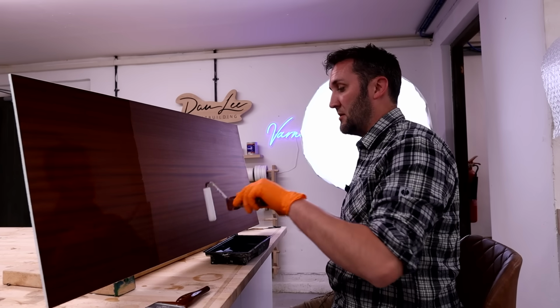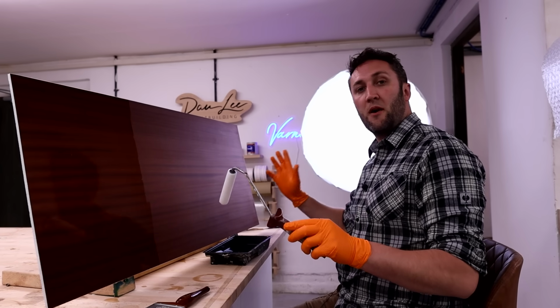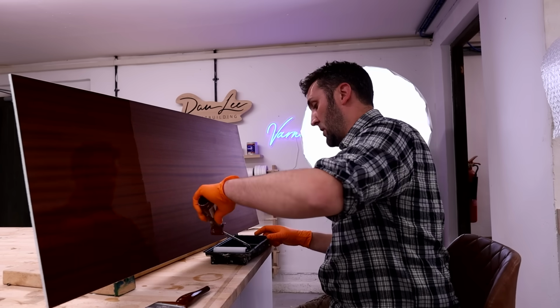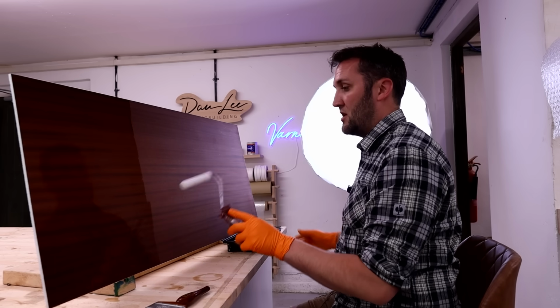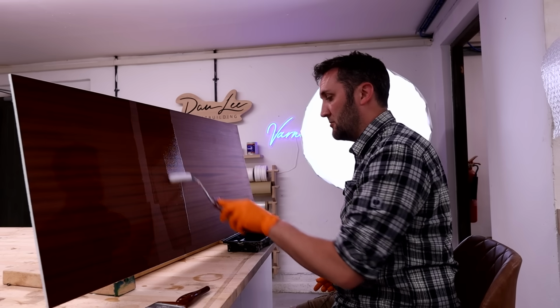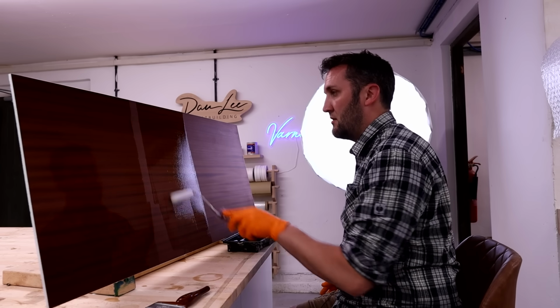And we're going to do the same thing. We're going to feather this section into that one so that we can constantly keep that evolving and leave the varnish alone on that surface as quickly as possible. So I'm going to come in here, just start slightly away from the next section so I can gauge how much is on my roller. Come and roll that in vertically.